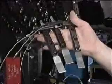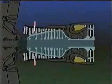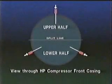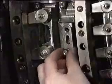Now, the HP compressor shaft support rods are fitted. These are required to support the front of the compressor shaft when it's separated at the curvic coupling, just behind the number 3 bearing. Without the supports, damage to the blade tips and seals could occur. These supports are fitted just behind the number 3 stator vanes, at 3 equally spaced positions. Remove the blanking plugs.